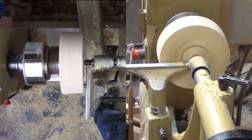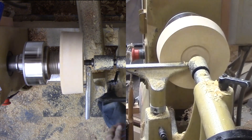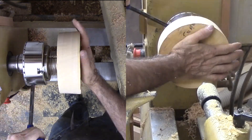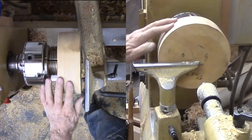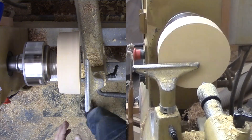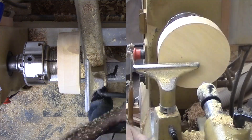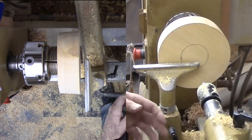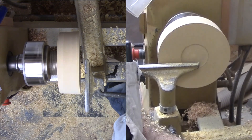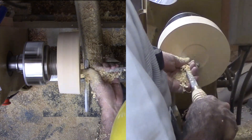Since I need a clean mortise and this is not it, I flip the block around into the mortise for a good solid mount. After trimming back the surface, I mark for a second mortise where I have clear access. I cut the mortise a bit deeper than what I want in the final bowl because I also taper from the bottom ring down to the mortise edge. The mortise does not need a lot of wood to hold. However, the wood needs a bit more thickness to not split out. In the end, my mortise will appear very shallow. The taper hides the additional wood needed to prevent a blowout.